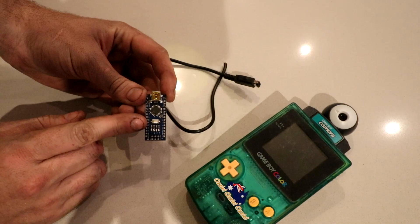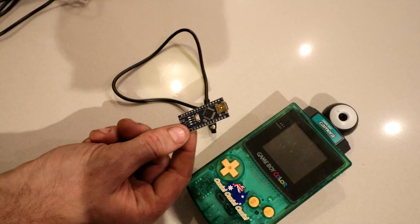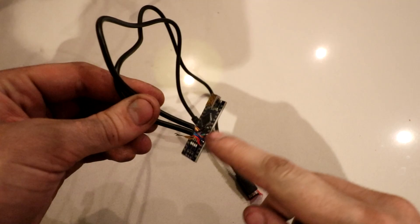You can actually just unplug it. What it allows us to do though, is take this — which is an Arduino. This is basically a really small, cheap, programmable computer. They're only a couple of dollars. What we're going to do is solder this to the Arduino, make the Game Boy think that this is the printer, and then rather than printing to paper, we're going to print to here. And then we should be able to transfer the pictures from here onto the computer.